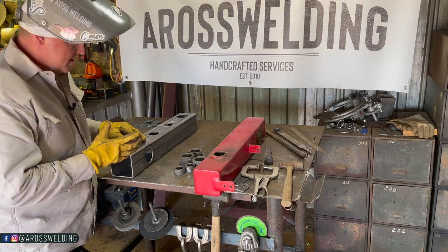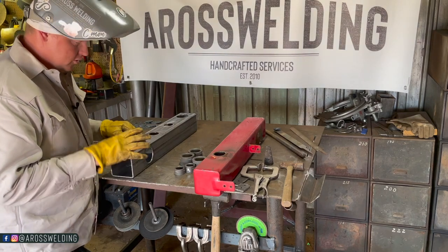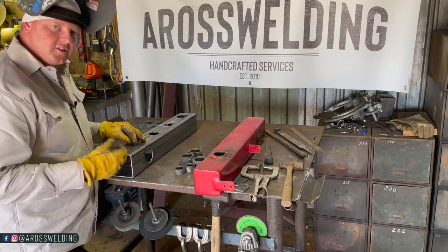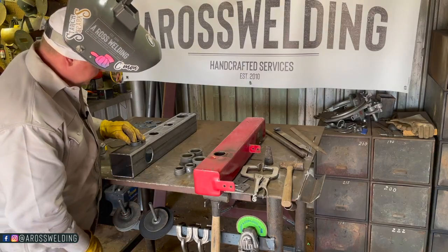Like I may weld it out. I probably might end up welding it out in that heat or those volts anyway. But whenever I'm tacking stuff up with a MIG, I do like to have it turned up. That way that tack sinks in there good.